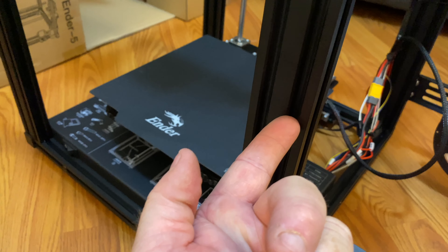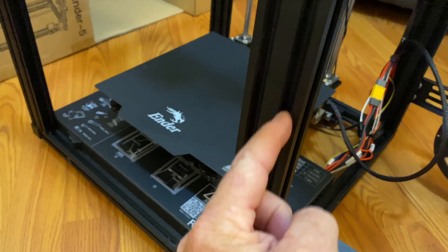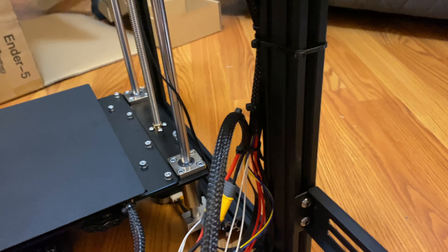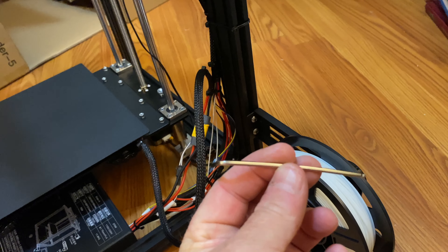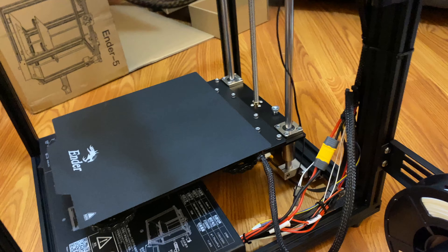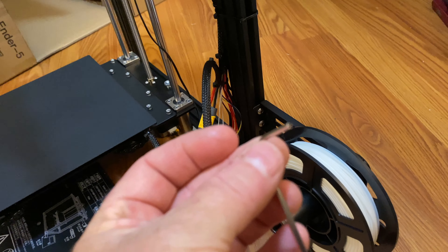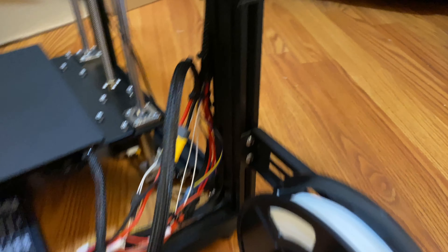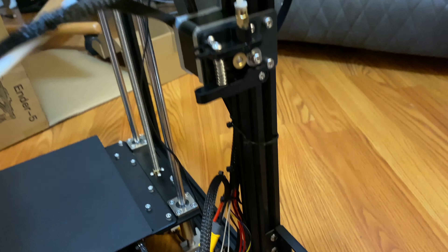So you're going to have to place that locking mechanism in here and then it needs to turn horizontal to lock in on a vertical channel. On a horizontal channel it has to go vertical, so it is a little challenging and they don't really turn on their own inside the channel. Also these smaller stainless steel hex bolts aren't very durable — you can see it's a little bent. I didn't really torque it too much and the tool kind of bent. One of them actually has a little burr on the end where the plating started coming off and it was harder to turn.